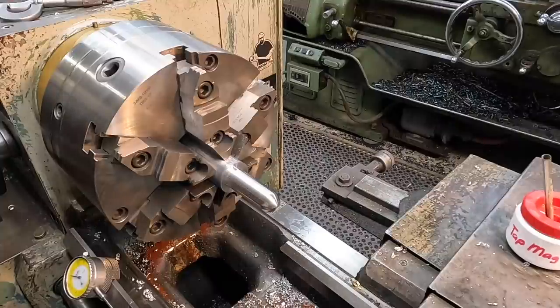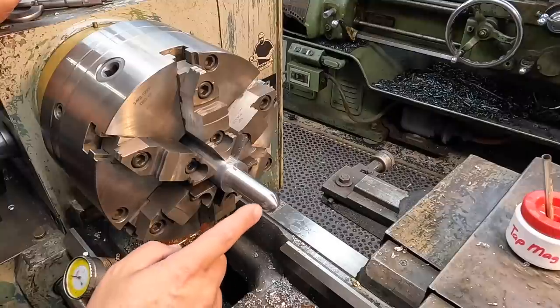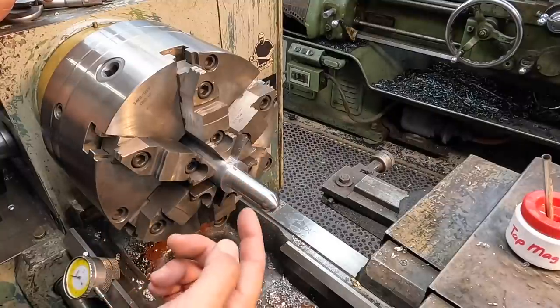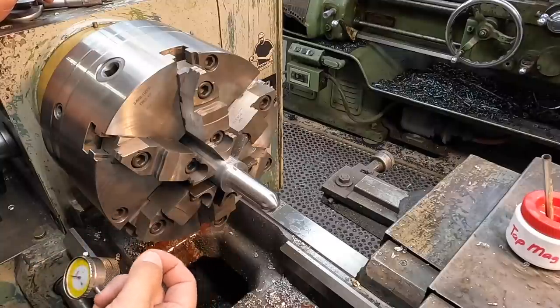So we've got our lathe work for one end completed right there. And what I did was I left that a little bit big, and after I cut the radius, I machined it to size, because the OD is actually 15/16. And the closest corner rounding end mill that I have is a half inch to match that radius.